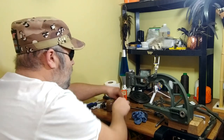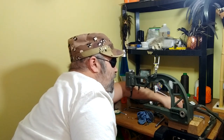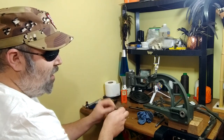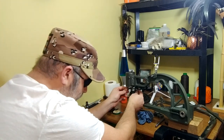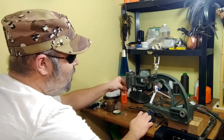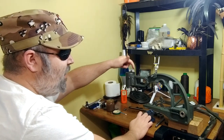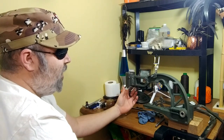Now we're going to put on the bottom plate, again taking some grease and running it around the edge and on the inside. We slide the notch over the presser foot and come up with it. Now that we've got that sandwich together, I like to push back and make it even so it sits a bit prettier. Then we can go ahead and put on the tabs underneath and attach it with the nuts — those nuts are 10 mil.